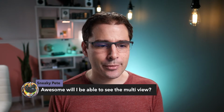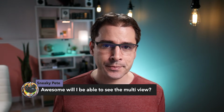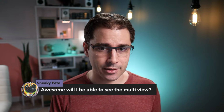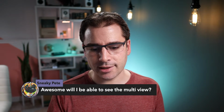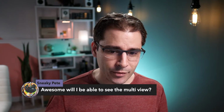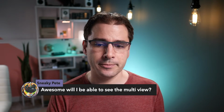Thank you. Oh, yes, Pete, follow up on the remote ATEM question. No, the multi-view, any video out, you're going to have to run through video cables. So seeing the multi-view, you'll need to run, HDMI is probably not going to work because it would need to be too long unless you use the fiber HDMI cables, or you could stream that using some other encoder or run a long SDI cable. So lots of options there, but yeah, you'll need to route the video separately from the control of it.